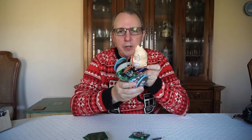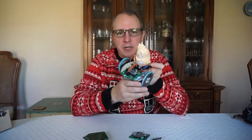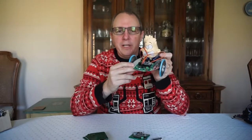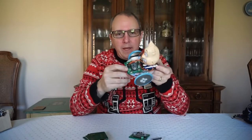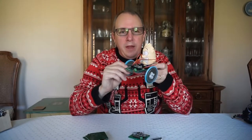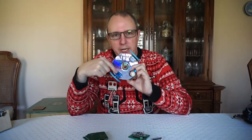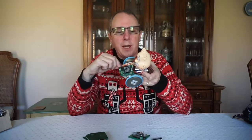Perhaps the most awesome part of the MyBot is the robot chassis, or body. I designed the electronics so they can be mounted on just about anything — cardboard, wood, plastic, or even an old CD. I really like the fact that you can use recycled materials for this purpose. Here's an example robot I built last week: the servo motors are just hot glued to the bottom of this CD, the electronics board is just taped onto the top along with the battery pack, and I added this funky little head.